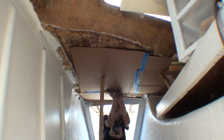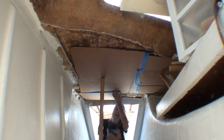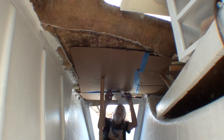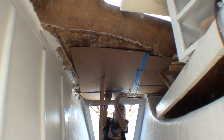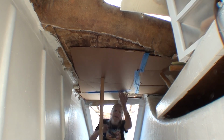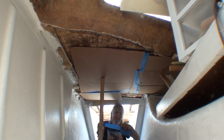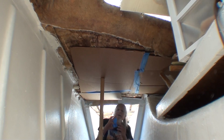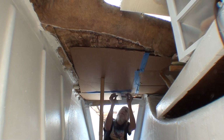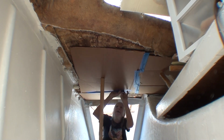The catamaran had rotten deck core just ahead of the cabin on both pontoons. And instead of cutting out the balsa from above, somebody decided to cut the core out from below. And then after that, somebody glued a piece of plywood to the ceiling to hide the hole. And that section of deck was always really soft when Trevor had the boat, because the plywood wasn't really shoved all the way up against the deck.